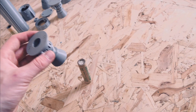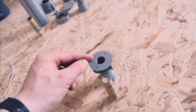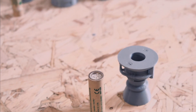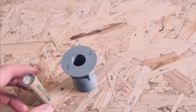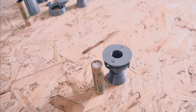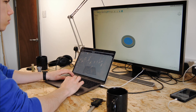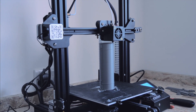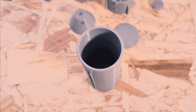If I leave it as is, it's just going to drop through the bottom, or obviously come straight out the top when we ignite it. So I need some sort of stopper to go on top. The ejection charge from the motor needs to still be allowed to come out of the top. So I'm going to make a little hole in the top of the stopper about the same diameter as the inside diameter. The main fuel tank also had to be hollowed out, as I needed the rocket's fuselage to be completely hollow so it could contain the parachute.